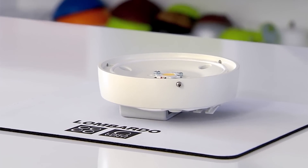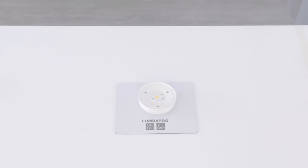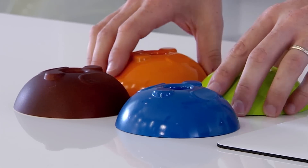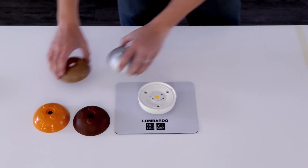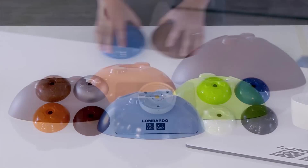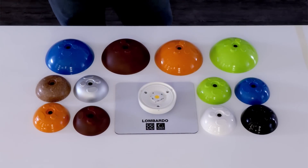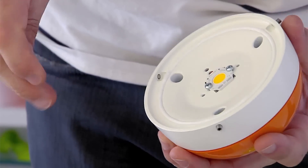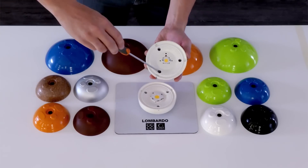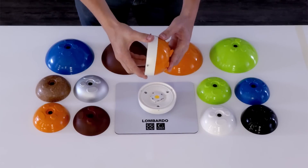In the catalogue, under the item 'actual lumen', the actual light output of the fitting is given once the optical part has been fitted on the motor. The motor as seen so far is not a light fitting — it has to be completed with an element for application to a securing surface. These are the securing bases, available in eight colors, coupled to the motor simply by means of three screws. Having done this, a first version of Quit is ready for installation.